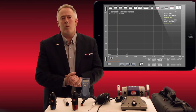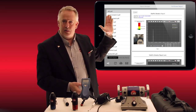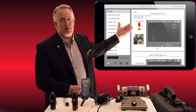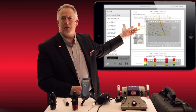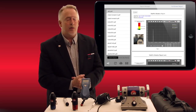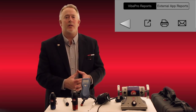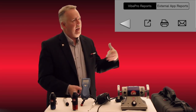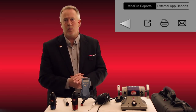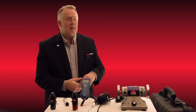Before launching into the main spectrum screen — as you run your spectrum, we've also built in a new report manager. When you click the report button, you'll see two spectrums: one in velocity and one in acceleration. You'll also see your map and a photo of your data point. This is what we call our single measurement mode, which enables you to email or save this report right from the device. You could be on the floor taking a measurement, see something of immediate importance, and email that to a superior right from the floor — saving time and downtime by getting information to the people that need it as quickly as possible.